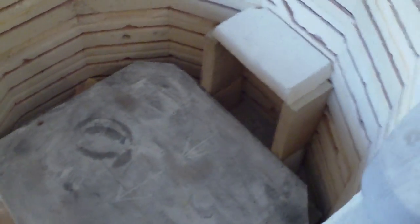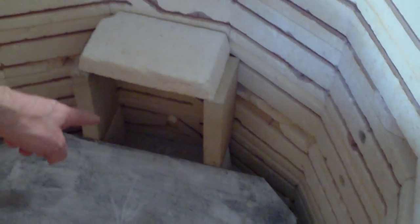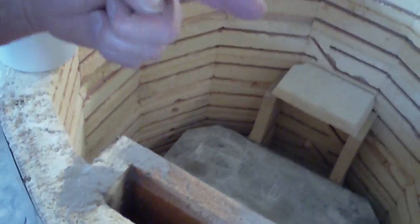That basically gives you the format of the kiln. With the downdraft kiln, we're not allowing the gases to escape through the roof of the kiln. A lot of kilns have just got flames come in at the bottom, a hole at the top, and they just go straight out. You can't really attain very high temperature by that kind of firing. So what you have to do is close off the top of the kiln — hot air rises, the flames and the heat go right up to the top of the kiln, but they can't escape and are forced down again. That's what that flue is for: to receive the flames once they've come down, take them underneath the bottom shelf, and then up the chimney and away.